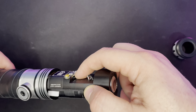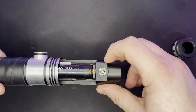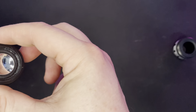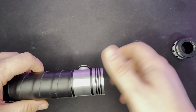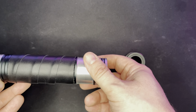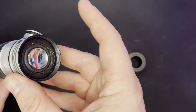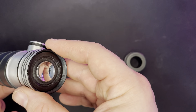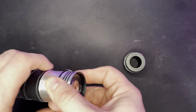You can remove the pommel at the bottom to access your chassis and your CFX board. You've got your micro USB port connection here, and your SD card is just located under here — push in to release and push in to reseat. You've also got your recharge port, your battery, and your 28mm base speaker. Saber Trio have now started replacing the 28mm speakers with 22mm or 24mm ones, so just be aware of that going forward.